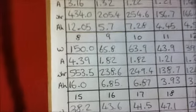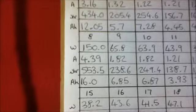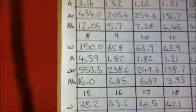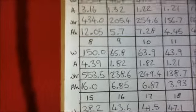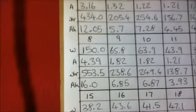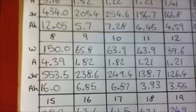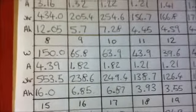watt hours. These figures look artificially high because on these days I run the inverter all day, so some of this power is being used directly to power the inverter rather than charge the batteries. Also, the batteries will only draw the power required to charge them, so if they are fully charged, like during the weekdays when I'm at work all day long, I would be using no power in the daytime and all the charge would be going into the battery bank.